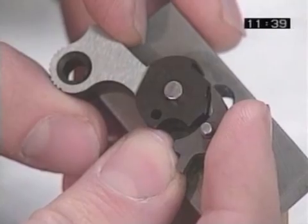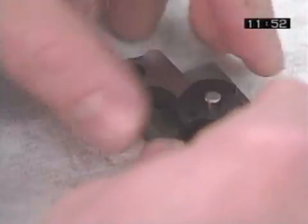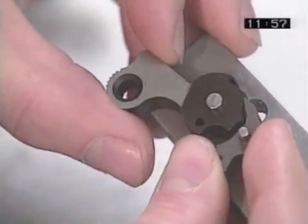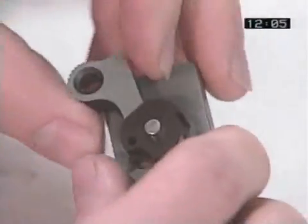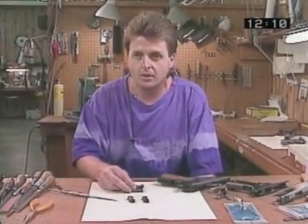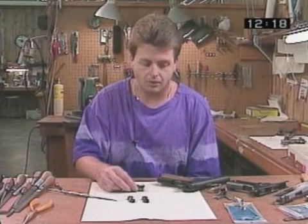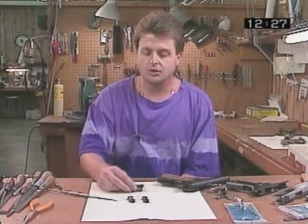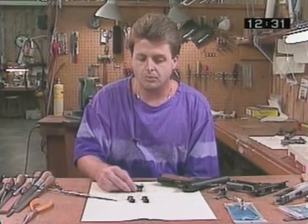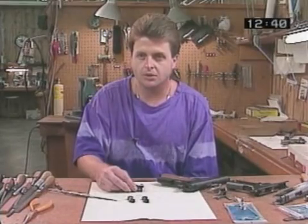Okay, if you removed extra material from the front of your hammer hooks, in this area right here, if you move this face back towards the back of it, you'd end up with your sear dropping in like it should. And you're talking just a little bit of material. Yeah, very little amount. Just a couple file marks. Some of them might be worse than others. All guns vary, and most of the time, they'll drop in anyway. But they are a little bit oversized, or used to be oversized, just for that reason. But now, on all of our current production, we've kind of phased out the thicker hammer hooks and everything. So now you shouldn't run into any problems like that. All of our hammers should basically drop in and work like they are. Okay, so for the current production models, you really just need a little fine adjustment then. Right, just polishing of what you've already got.